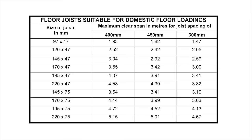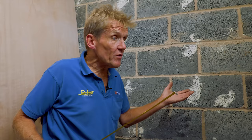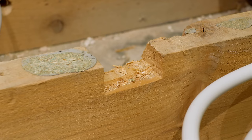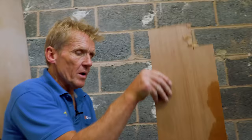Interestingly, if you check the span of the joist in this particular case, the support wall is just behind there. I measured the span of this joist, then looked at the span tables — which you can get on the internet — and it works out that for that span all you need is a six-inch joist. So happy days — we've got a joist which is two inches oversized, actually over eight inches. The reason it's that size is because there are longer spans elsewhere in the house, so all the joists were made the same depth. In this case they're oversized; in other cases they'll be on their limits. So it's really one of those things where you check the regs, look at the individual situation, and work out what's permissible.